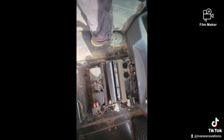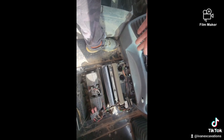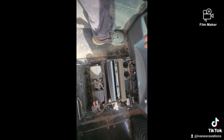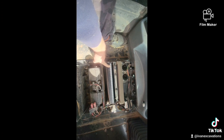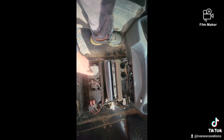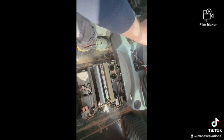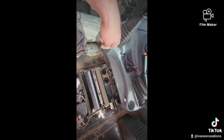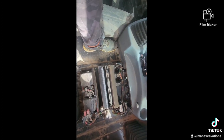This is for the hot system. Pretty stupid design, because if you're in winter and you want to have the aircon on — let's say it's just a little bit warm outside — it's not going to go 100%, as hot water goes through that. The blower is here pushing air through the aircon first and then through the hot system, which shouldn't be working, and then into the cab. There is a valve under the bonnet near the engine you have to shut down so hot water doesn't come into this, which is a little bit of a pain.